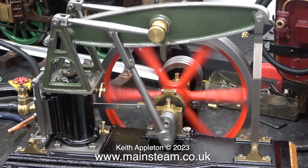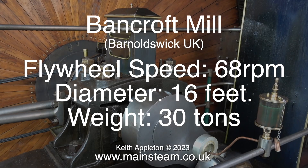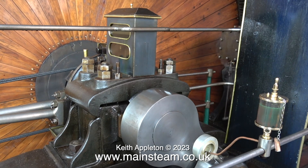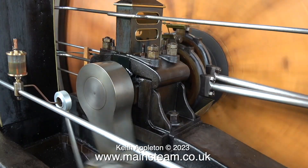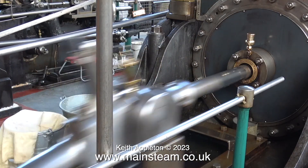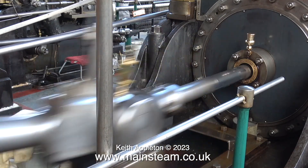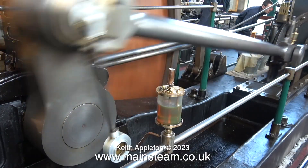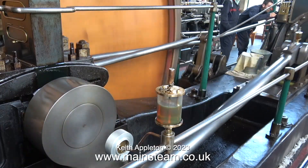It's really down to the size and weight of the flywheel. Here's a specification for the flywheel at Bancroft Mill: flywheel speed 68 RPM, diameter 16 feet, and weight 30 tons — just slightly heavier than the steam engines I work with. I messaged my friend in the USA, the amazing Alexander Cairns. Alexander's knowledge base for everything to do with steam engines is astounding. The question that I asked him was which way should the flywheel rotate on a non-reversing horizontal mill engine.